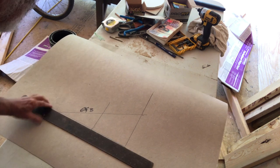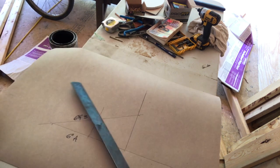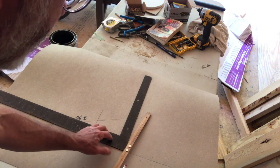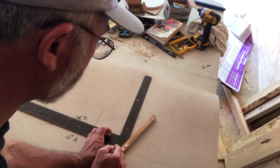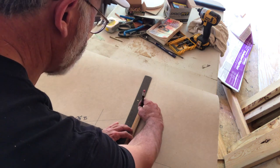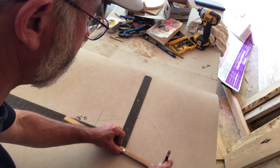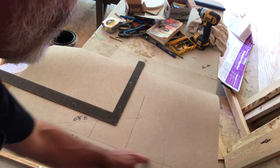Now I'm ready to make the ellipse using the framing square. I extend the bottom line over a ways, then put the framing square back in place, lined up with my horizontal and vertical lines — that stays right there. What moves is the trammel. The two pins key onto the bottom of the square on the bottom line and the upper pin on the upright. It's a little bit of a trick to coordinate yourself to do this, but not that bad. That is one quarter of the ellipse.